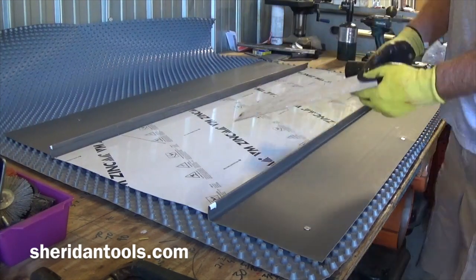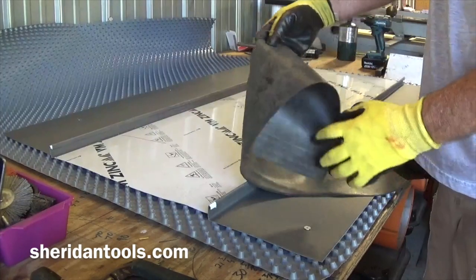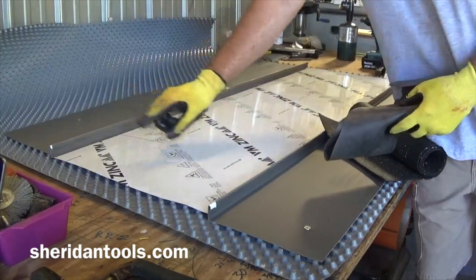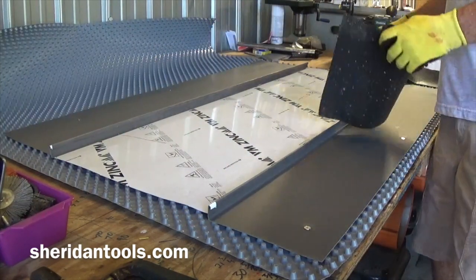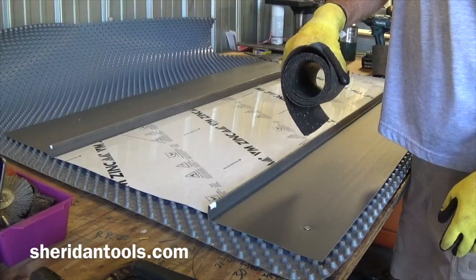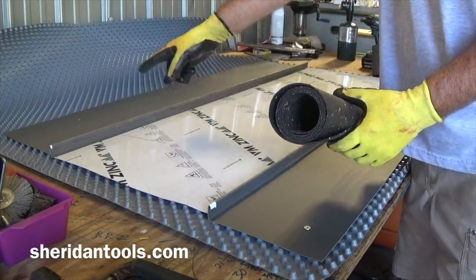You're going to need something to protect the panels on either side of the repair. So 16 gauge piece of stainless steel. This is a piece of 045 EPDM. Pretty thin. This will help protect the material that you're trying to save on either side of the repair panel. And then this is just standard toolbox shelf liner, again for protecting the stuff that you don't want to damage. The only thing we want to concern ourselves with is getting this panel out, getting the new panel in, and do no damage to panels on either side.